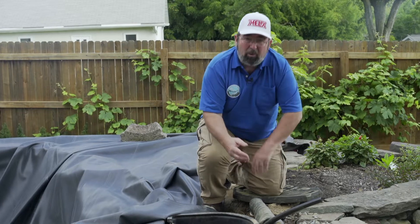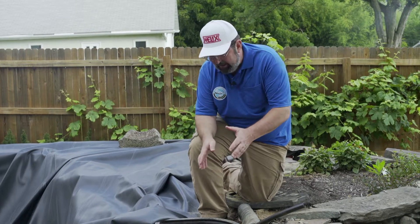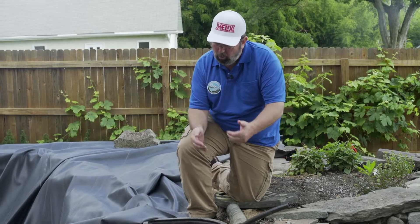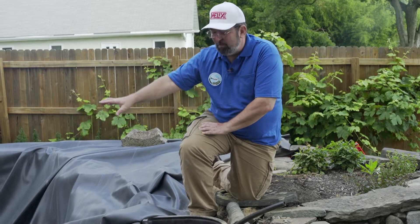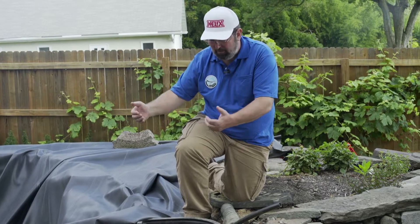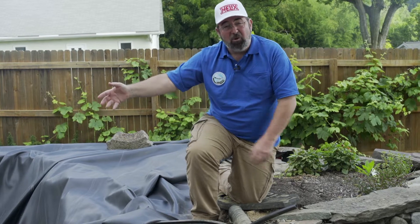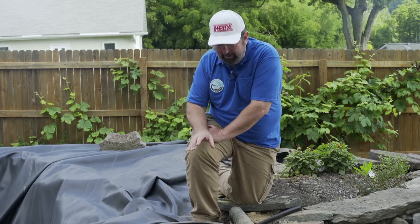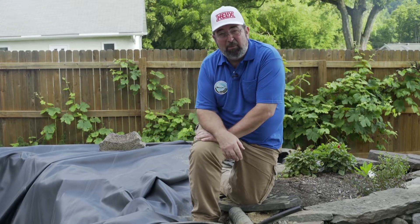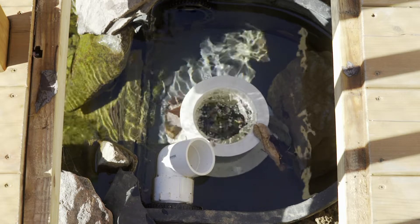In addition to that, your pump is either going to be in the skimmer or beyond the skimmer. In our case it's an external pump — we've got piping that goes to where the pump is located in the basement inside the house. Either way, your pump is not in the pond, your tubing is not in the pond, your electric cords are not in the pond, so it removes a lot of unsightly things. It protects your pump, it hides your pump, and it takes all the floating debris off the top of the pond before it saturates and sinks to the bottom.